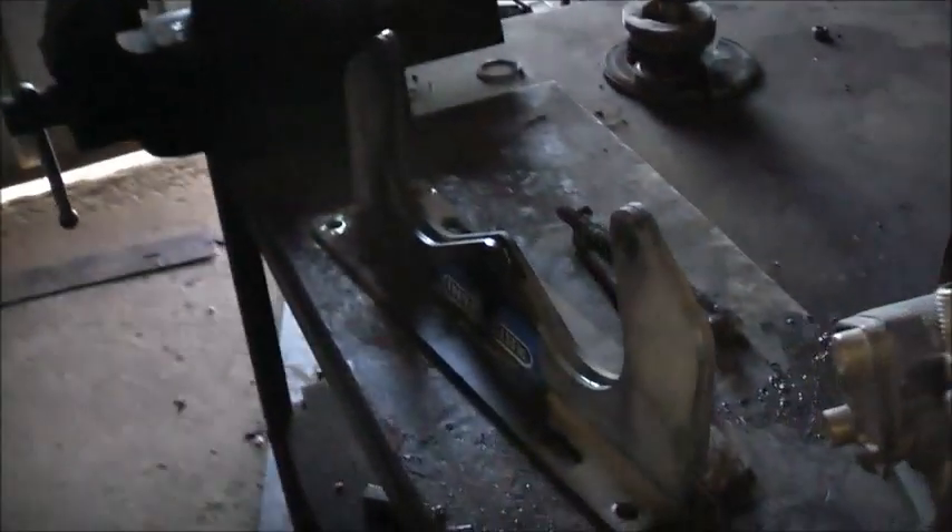A bit of a dry one. Oil was good — SAE 30 they take. To the brim there, max. No problem with the oil. The main problem is bolts that were loose from the factory. They bolted these plates here and clamped them on tight. Well, whoever made this didn't tighten those plates up all the way.